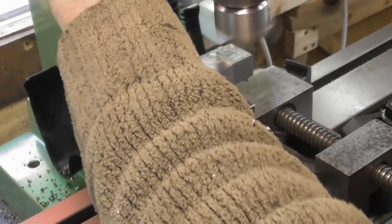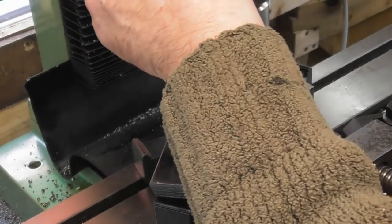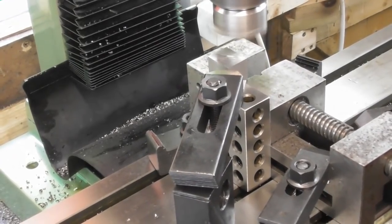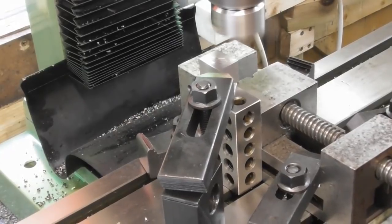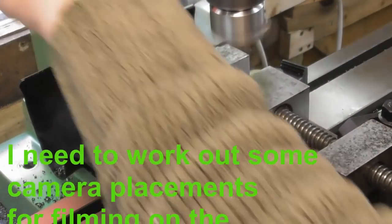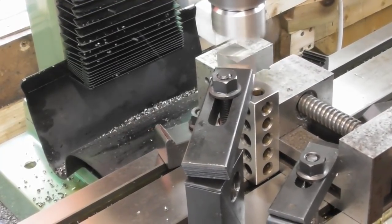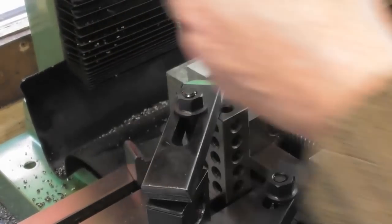Just okay. So I need to wind down. Let's go 1/2 mil at a time. I'm still getting the hang of which way to turn things. There's 1 more mil to come off. At least 0.5. Just about cleaned up. There wasn't actually that much difference in the two parts. Leave 0.1 to come off.